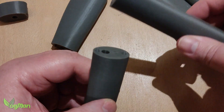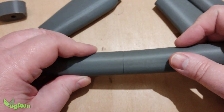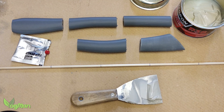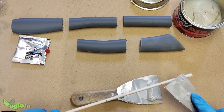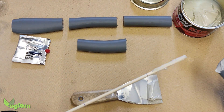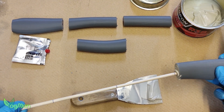Moving onto the handle — just as a reminder, I've included witness marks and location studs for easy alignment. Because of the nature of FDM printers, you may need to sand the very tips of these points for better fitting. Here I'll be joining the handle sections with car body filler — a messy but strong and practical process. You can see that I've marked the dowel so that I know where each section begins and ends. A lot of this filler will ooze out, but avoid the temptation to try and clean things up at this stage — you'll just make more mess.